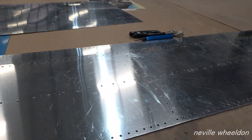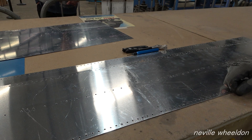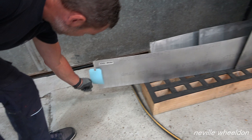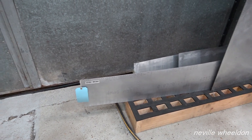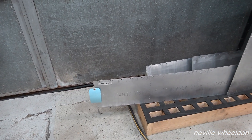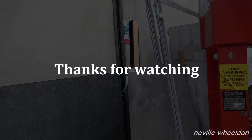You've got to put the rose bit on all these holes, deburr them all and scuff them all up. You've got to put your tags on so you know which ones are done. These are all for the painter — these ones with the blue tag which says where each skin goes, so we know when it comes back where it goes. It's the inside face, which will obviously come off after painting. It just gives the painter an idea. And he's got all these stringers to do as well — he's got some work ahead when he comes back next week.